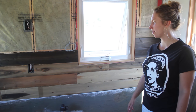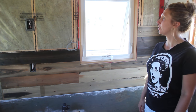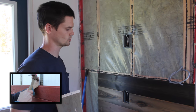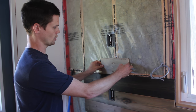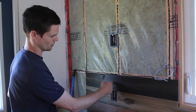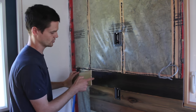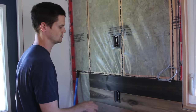Now we're putting up our end wall pieces, using some of the crappier ones lower down because the countertop is going to come to about here. As we work our way up, we're being more selective to make a nice pattern. The installation is very similar to how we did the exterior siding — we did some measurements to figure out a story pole to make sure we weren't going to end up with a tiny sliver to wedge in. I've got a scrap piece I put over whatever piece I'm working on to hammer it down without damaging the tongue, and I also use that piece to make marks for notch depth.